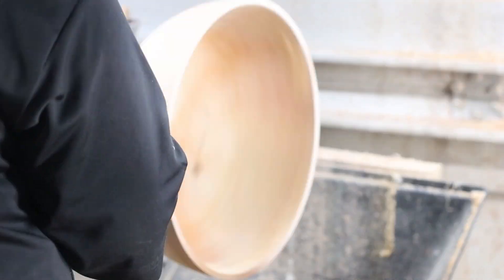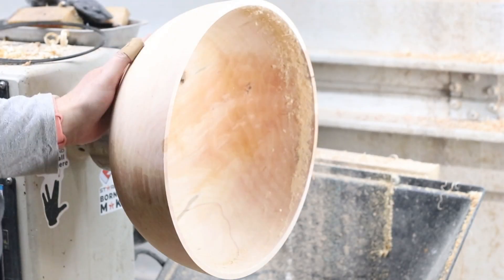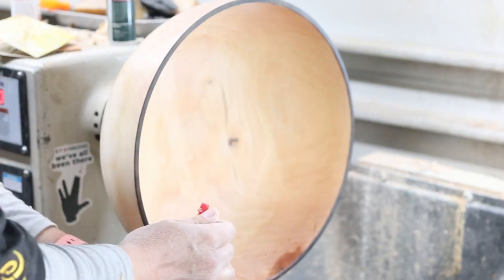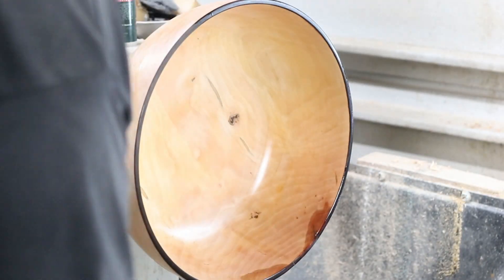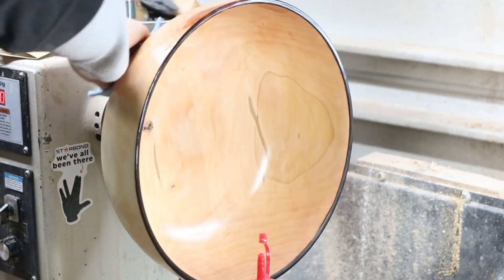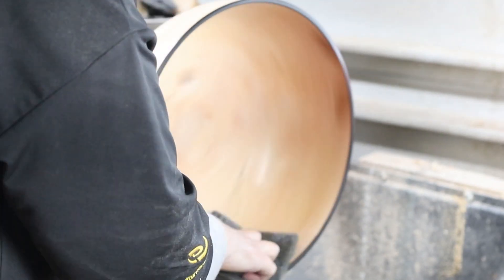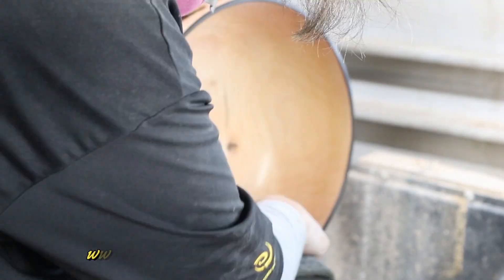I will get to the sanding. I started at 60 grit and worked my way all the way through to 400. After sanding, I wiped it back with denatured alcohol and applied one coat of sanding sealer, let that dry completely, and then denibbed it with a Scotch-Brite pad. After the sanding sealer and denibbing, I wiped it back again with denatured alcohol before applying Brad's sanding paste. I noticed after denibbing that I could still see lines from the sanding sealer.